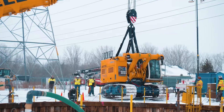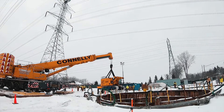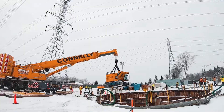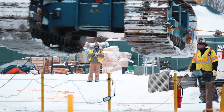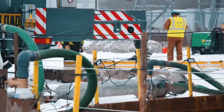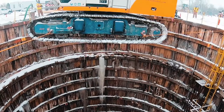Our first step was to lower the base machine in. We connect it to the lower base of the machine to lower it into the shaft with the support of a 400-ton crane. Just to keep the machine steady, keep it from spinning and swinging, we attach four tag lines to it — one at each corner — to have guys up top steady it and keep it a controlled load.